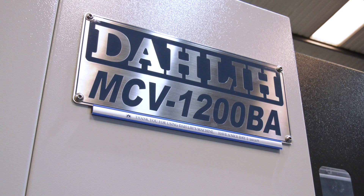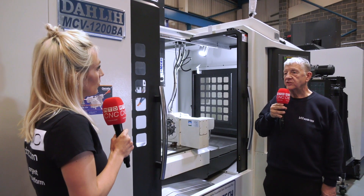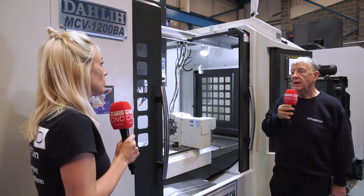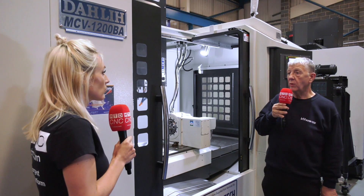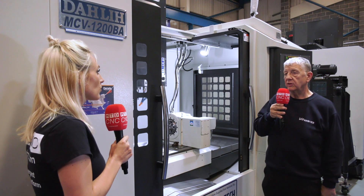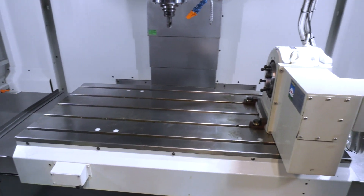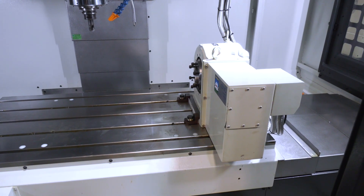This is our second machine and it's quite an interesting machine. It's got a 15,000 RPM spindle — BBT40 or BT40, depending on the customer's choice — and we've got 25 horsepower with lots of torque at the low end because it's a dual-wound motor. It's up to 36 metres a minute in X and Y, 30 metres in Z, and we've got a good daylight dimension of 750 millimetres.